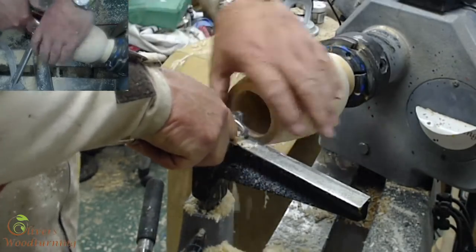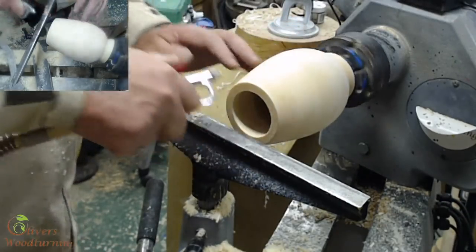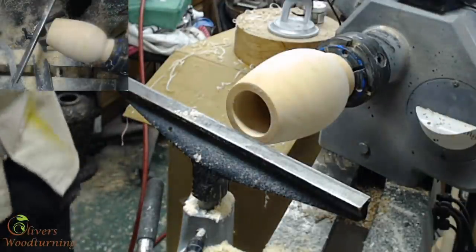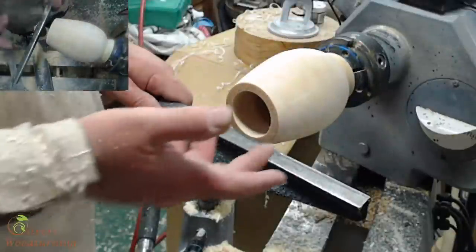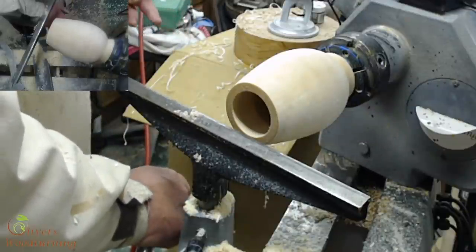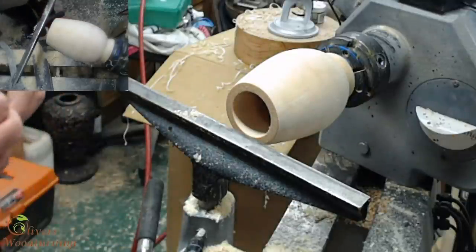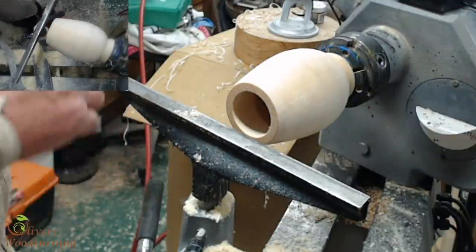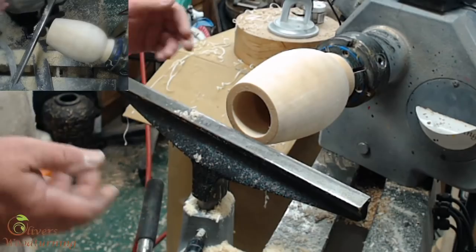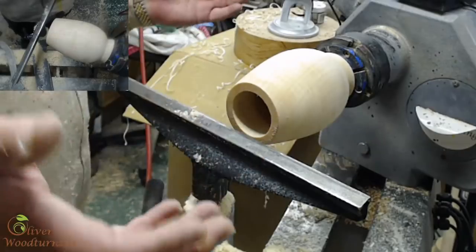What is the silent air compressor? Oh, right. The silent air compressor is a Bambi. B-A-M-B-I. Silent compressors. They work off a fridge motor, so they're not that powerful. You get about 1 CFM per pot. My big one is a twin pot, and I've got a small portable for airbrushing, which is a single pot. And they work fine. If you want power, then unfortunately, unless you're going to spend a fortune, you've got to use the big industrial compressors.